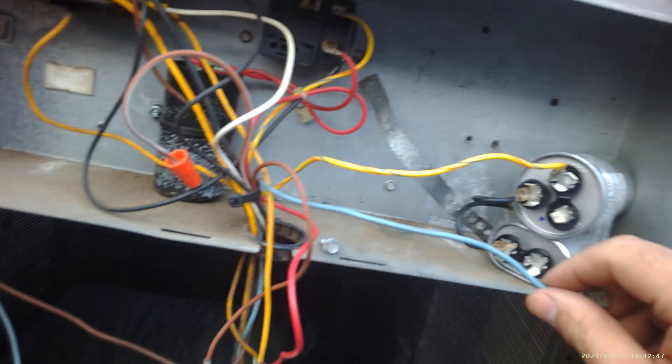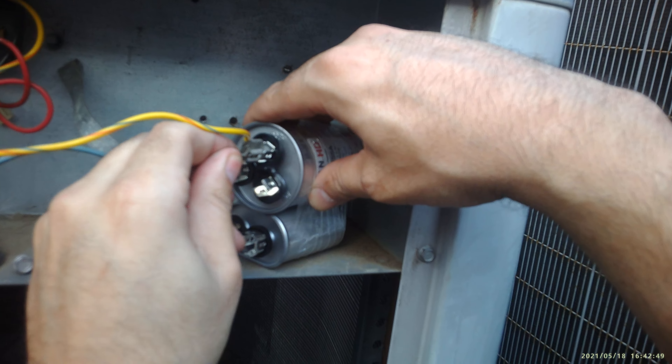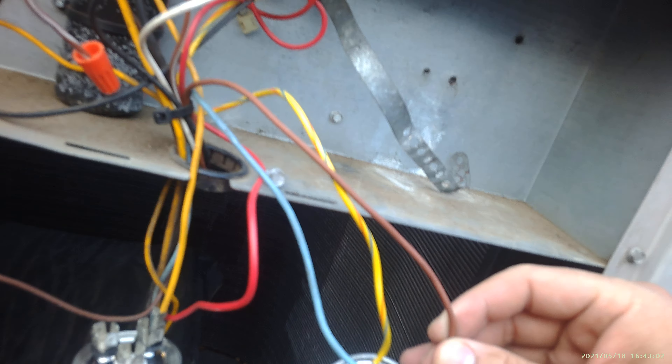Take the other hermetic — that's the best way to prevent confusion. Next wire is your fan. Now, I'm against using two capacitors like this because first of all it doesn't look professional, but in a situation like this when you have no choice, it's okay to do this.